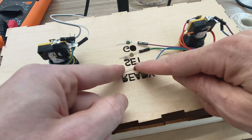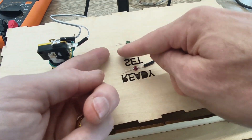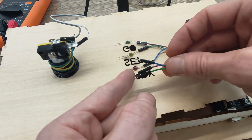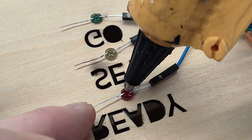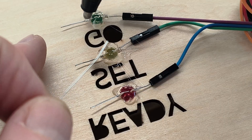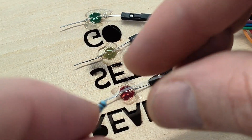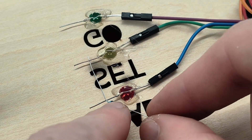So I'm going to be soldering on the LEDs. The short leg is going to the left, so this is going to be common ground, and then we have the positive wires going to these header pins here. So we are going to solder that. I'm going to put a block of hot glue just so that these guys don't come out — so if you laser cut the hole correctly you wouldn't have to do that step. Then I have a 1K ohm resistor because I'm only going to have one of these LEDs on at the same time.